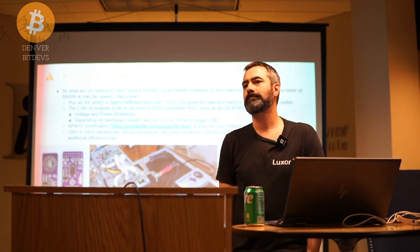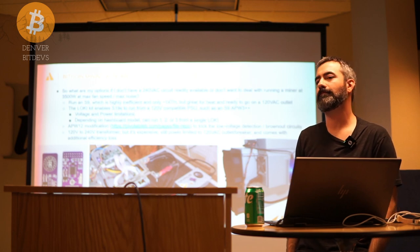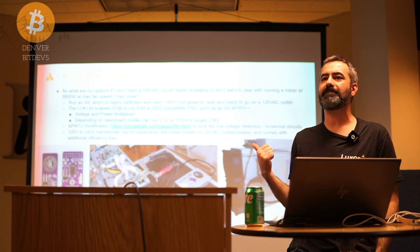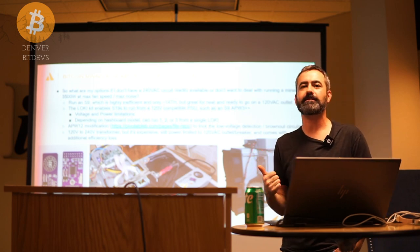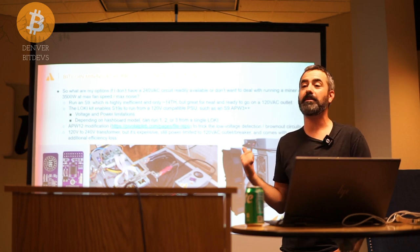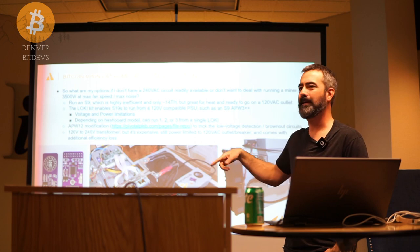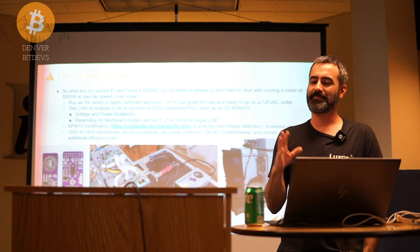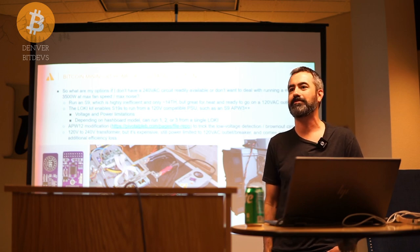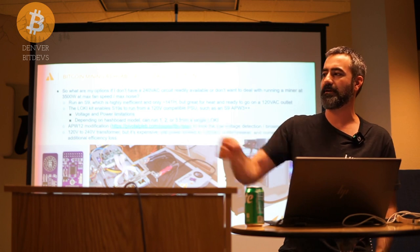Yeah, Hunter. So those bus bars look like they're unprotected. Yes. Are those electrically live? They are. So they are unprotected. They're live, but it's DC voltage. It's high current, low voltage. It's not a direct shock hazard, but what always worries me is the short hazard. If you dropped even a paperclip across there, you're going to have some fireworks because you're going to have potentially 200 amps go through that paperclip. That's why I brought it covered and safe.